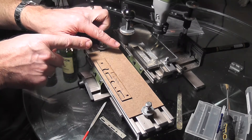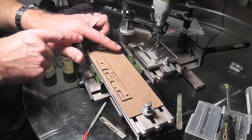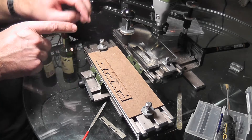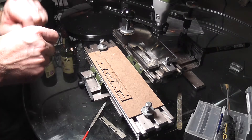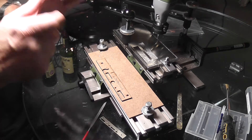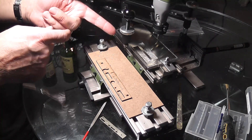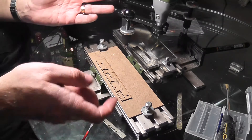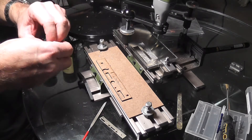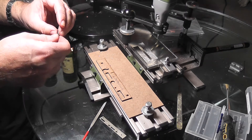There are two things with that stylus: first, it's a tapered stylus, and secondly, the stylus had no correspondence with the diameter of the cutting bit I was using. It was not very far out — I was using a 0.8mm cutting bit and the stylus was around 1.5mm at the business end. That needed sorting because I wanted more accuracy.